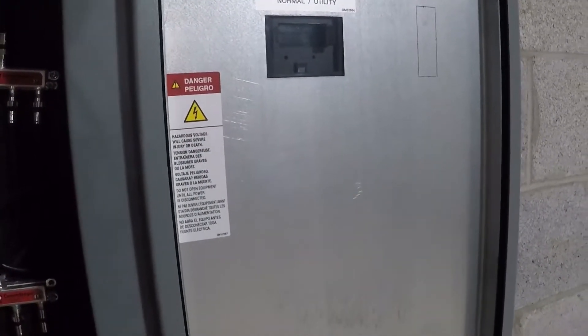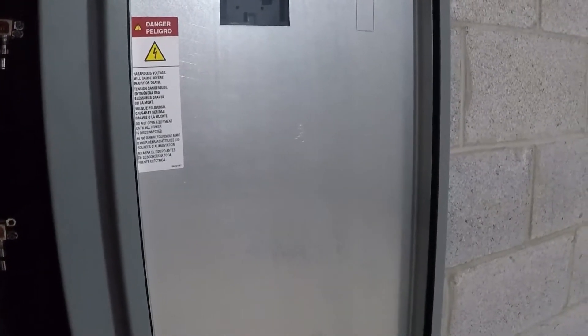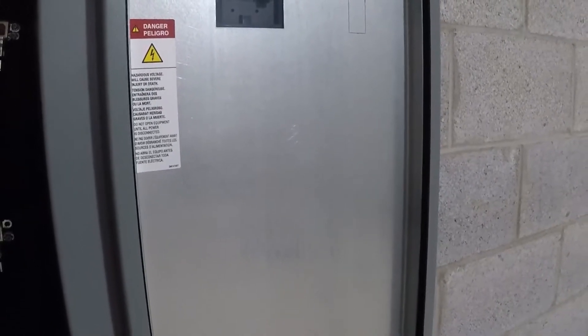I have my generator on a slight delay of about five seconds, so that if I get a power outage for just a second or two, the generator isn't trying to jump on for a really minor short outage. On the opposite side of that, I have the same concept — the generator stays running for an additional three minutes after power comes back on. If the generator's been running for a while and is up to full temperature, it runs a cooldown cycle where it brings the RPMs down slowly instead of just shutting off.